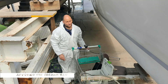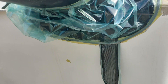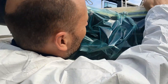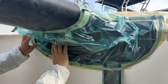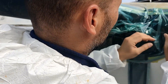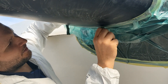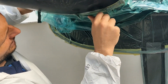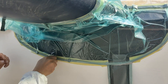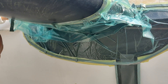I'm about to turn the vacuum pump on — I've got to be quick because this is going to evacuate my bag fairly rapidly. There are still lots of big holes in it, so I'm going to start manipulating my bag to sit where I want it. Making sure it sits right in these corners, then going around squishing all the tacky tape in, making sure it's all sealed, because I've got lots of little tiny air leaks between the holes and the tacky tape.